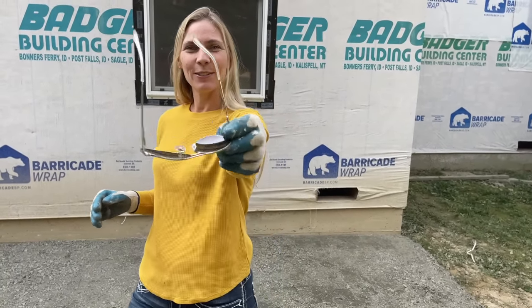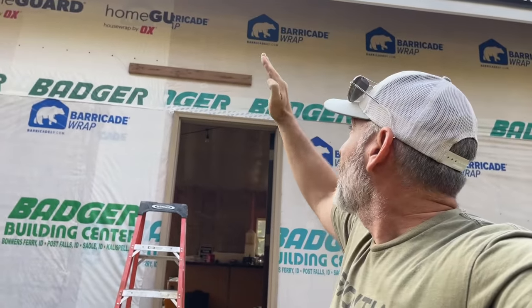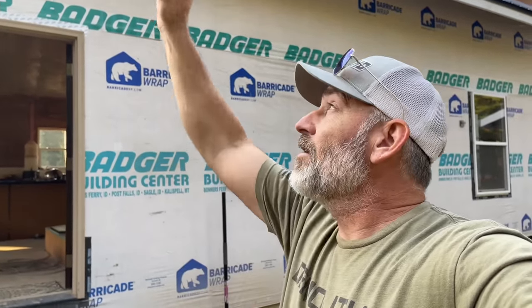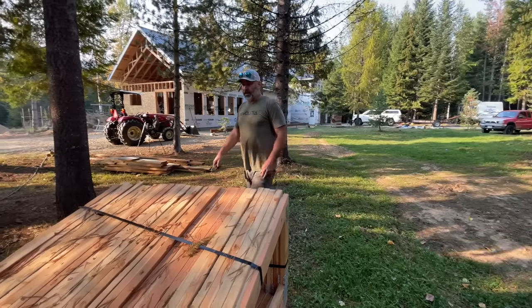I just came up with a really smart idea - at least I think it's smart. I've been mulling over how to figure out exactly how long to make each post. We found out that all of the posts can be the same length because this thing's level laying on here. We're going to put one truss up here and support it with a two-by-four, then we measure from that truss down to the beam and that's how long the post needs to be. Now we got a plan! Alright, so we've got to get these bands off of here.